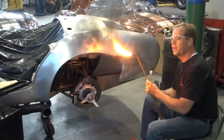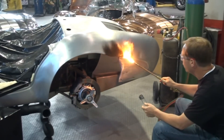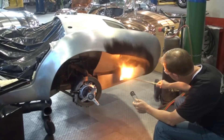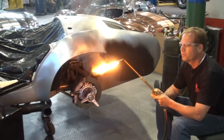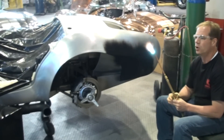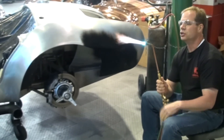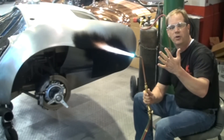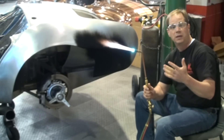This is how you anneal. You see this flame that I have has a lot of soot coming off it. Soot is really wonderful — I can paint that fender just like this with the soot. Get the fender all nice and black. I'm going to adjust the flame to a neutral flame. I've got a rosebud torch on here — big torch, big flame. It's neutral. I've pulled the cones back together. And now all I really have to do is just burn that soot off.